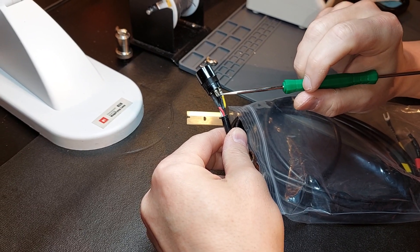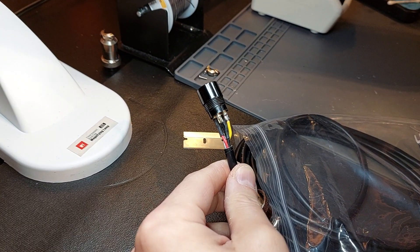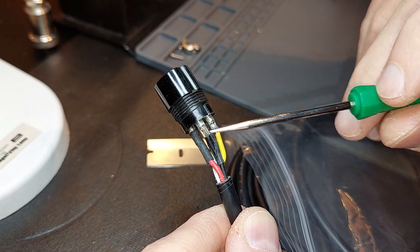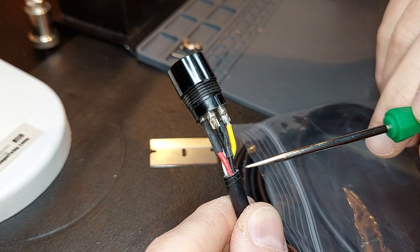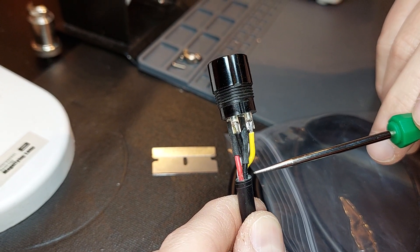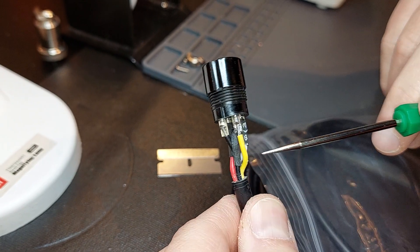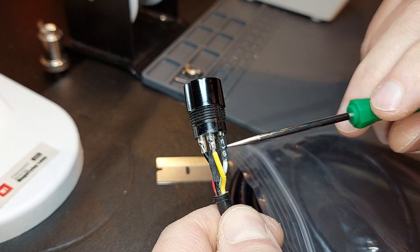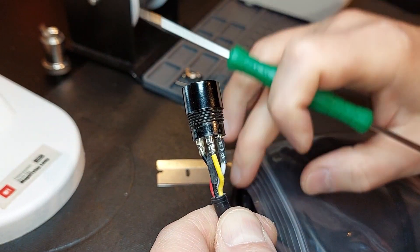After close investigation, opening up one of these bulk-made connectors, you can see what we have here. I've removed two pieces of shrink wrap because they individually heat shrink these — they can do that because this cable is not shielded, not double shielded. It is a mess to say the least. You can see fraying all over these connectors.